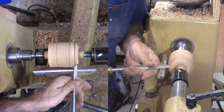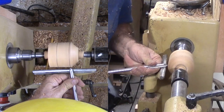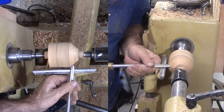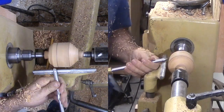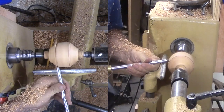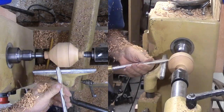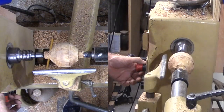Now for those 45-degree cuts to cut the first corners. The hardest part is to pay attention to starting the cut with the gouge flute closed, then gradually work it down, evenly reducing the distance from the cut to the target marks on the side and end of the cylinder. Do not worry about being exact — this process is largely self-correcting. I am also trimming back the nubs just a little, but not too much. I am not ready to dismount the wood yet.